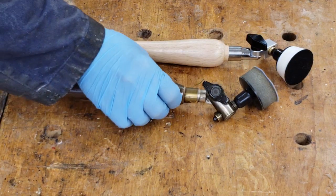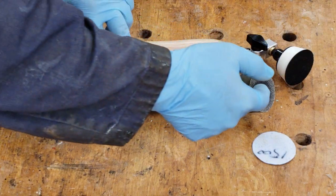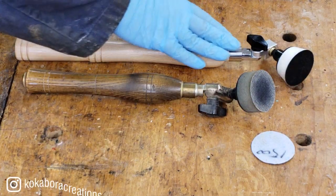Let me tell you why I bought so many. This is my original tool and I've had it for so many years — and there lies the problem. I have only one of these tools, and anytime I had to change the sandpaper I had to unhook it and then loop the other one on. All this frequent hooking and unhooking wears off the hooks of the sanding pad and the loops of the cloth fabric on the sandpaper disc, and within five or six changes they don't hold anymore. Anytime the disc spins it becomes a flying saucer. Now I'm gonna have a dedicated tool for each sandpaper grit that I use.